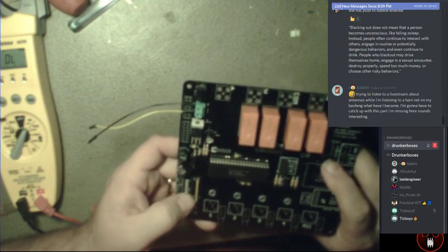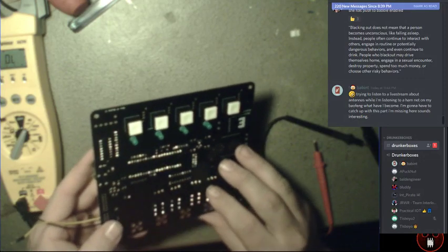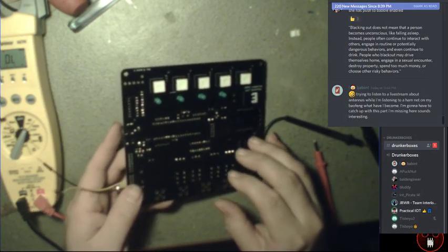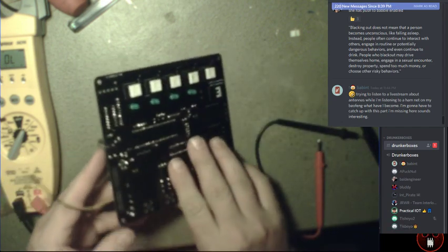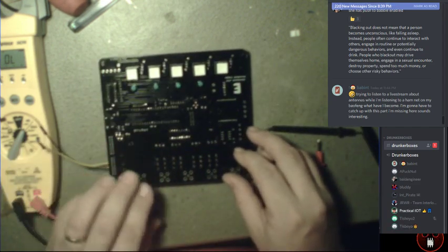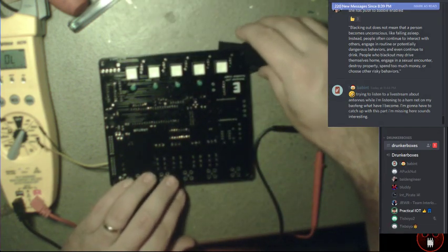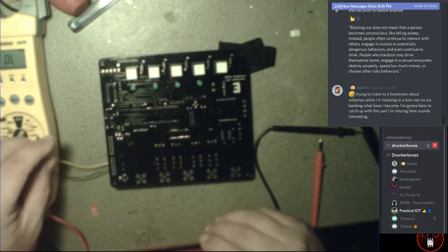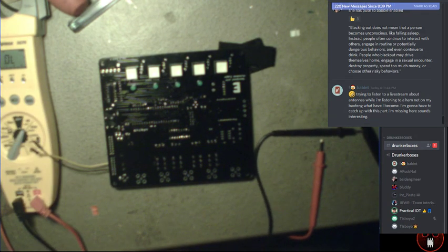I have two thoughts there, but I'm going to try to stick with one. What the hell is ladder line? Okay. Do you remember when you were a kid and your TV antenna had this flat cable that was 2-conductor and usually brown? Yeah. They call it twin lead. Ladder line is just a very slight deviation from that design that's a little bit larger physically, but same exact concept. It's a balanced transmission line.